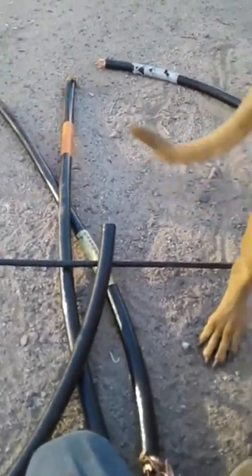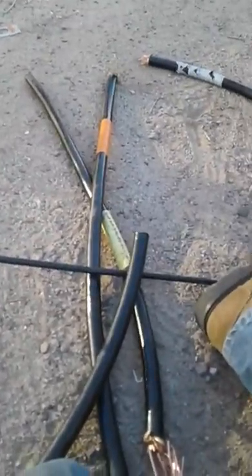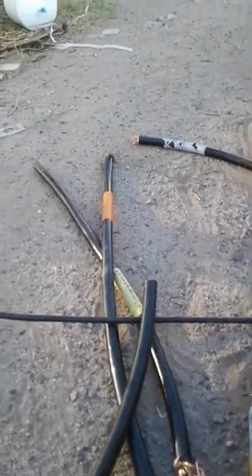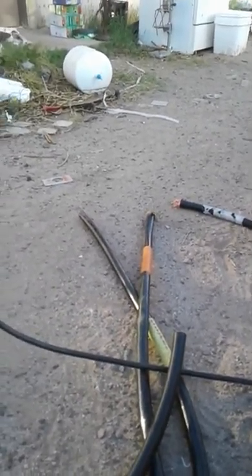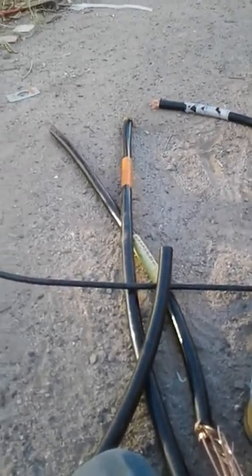It was a lot easier getting it through the junction box up top, though I had a hard time with it at first. If you look at my video about installing industrial equipment, you'll see the junction box and what I had to go through to get this through there. It took two of us — one person had to actually hold the wire up while the other person fed it through. It kept the wire from twisting up inside the junction box, which was the first problem that we had. The second time around, everything just slipped right through. You've got to have two people: one holding the wire up and one feeding it through in the right direction, because if you don't feed it through in the right direction it will twist up, and it is really hard to try to twist this stuff when it's already inside the box.